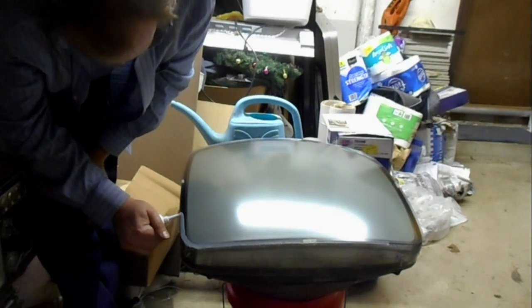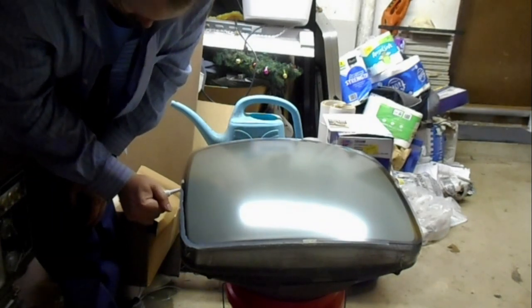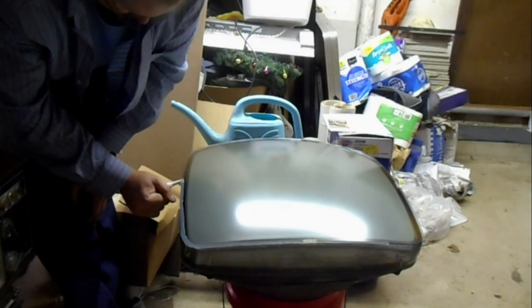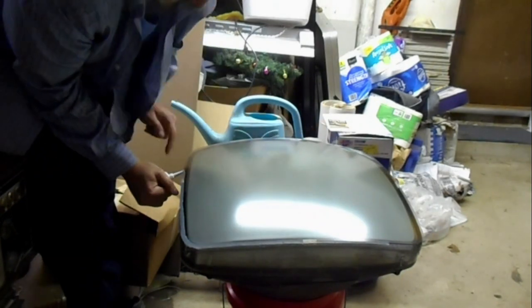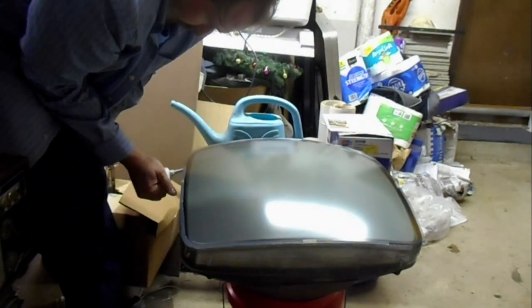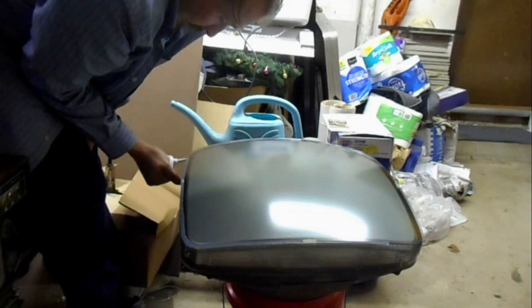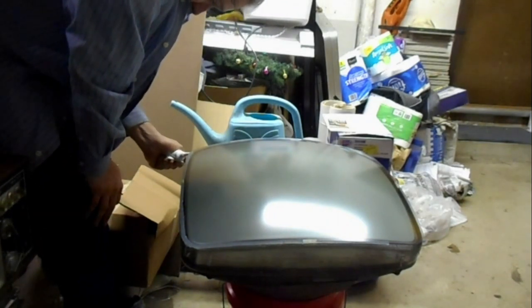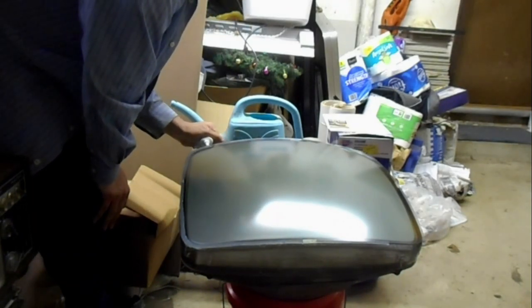During that time period, you could get two styles of CRT safety glass. You could get bonded, where it was glued to the face of the CRT, and non-bonded, where the safety glass was still in front of the face of the CRT, but instead of being glued all the way across the surface with PVA, the glass was not glued and had a rubber gasket around its perimeter. The rubber gasket would space it and seal out contamination, and fingers on the mounting hardware would hold the safety glass to the face of the screen.